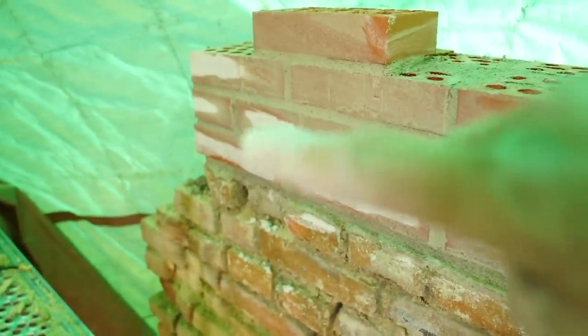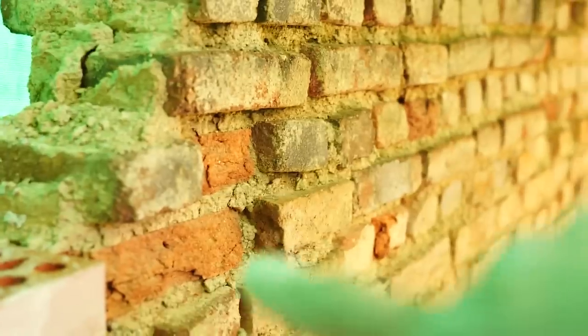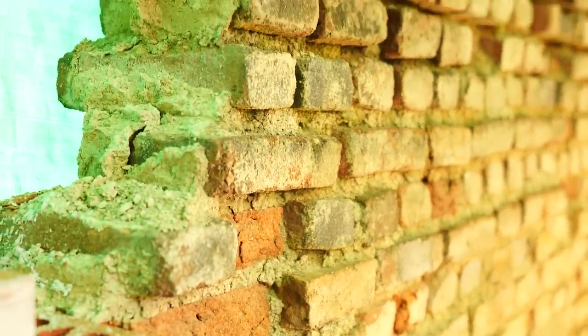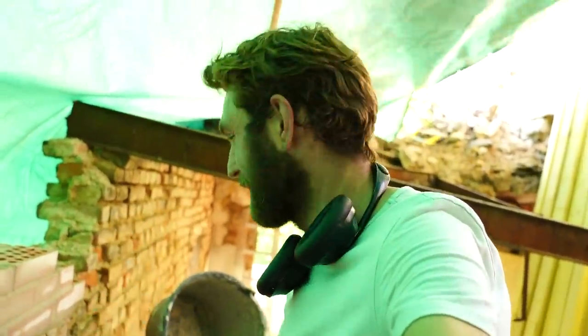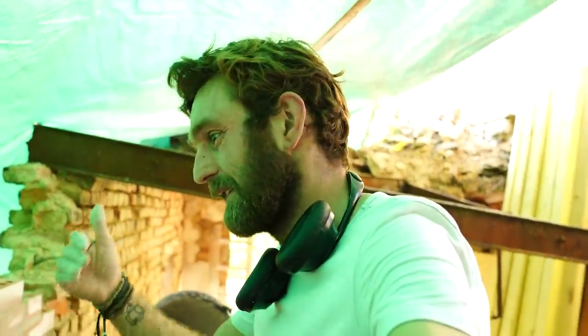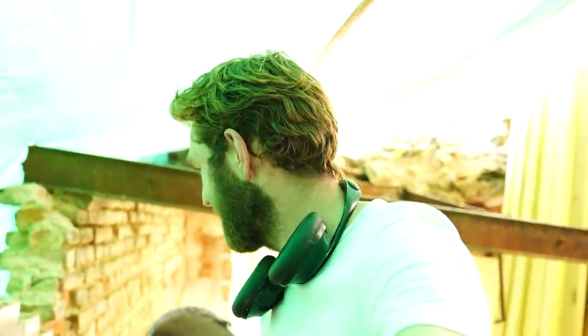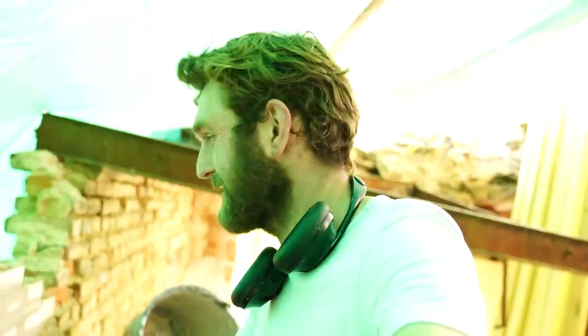This brickwork is double skinned, and maybe you saw when I was building it, I'm doing a brick back every so often just to brace it together. The way they did it was all the bricks one way and then all the bricks the other, but I'm no expert, I just feel like this will be stronger. And it'll look nice and neat. It doesn't look like I've done much. It's been such a hard day.